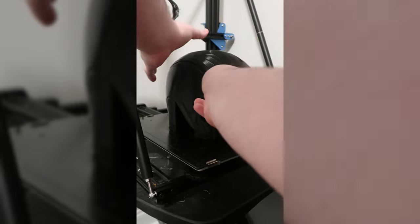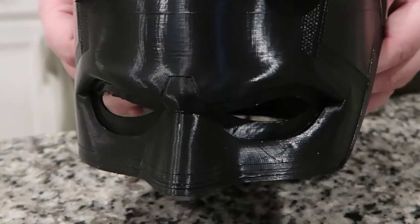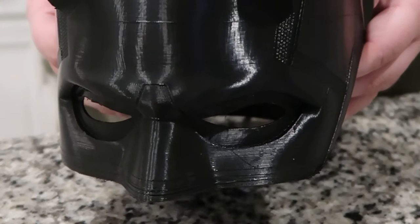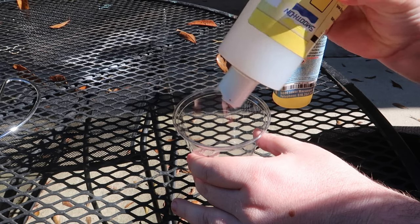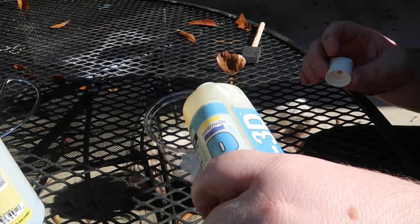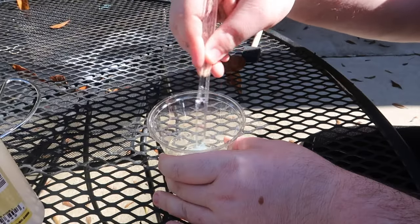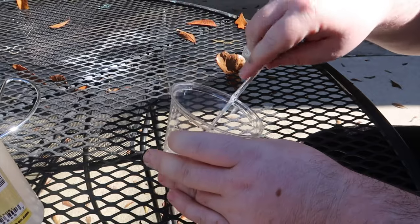When I took the helmet off the bed, I did notice that some of the layers at the bottom of the helmet did not adhere to each other very well. So before we start the typical post-process work, we're gonna have a little bit more work to do. We're gonna use XTC 3D on the bottom of the helmet, and it should act as a protective resin coating. And once it's cured, we should be able to sand it smooth. If you've never worked with XTC 3D before, I'll be sure to add a link in the description below.